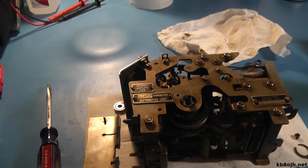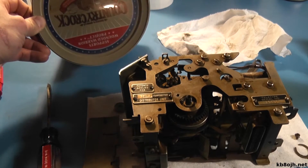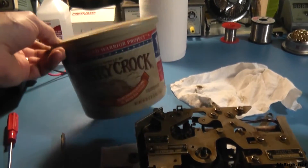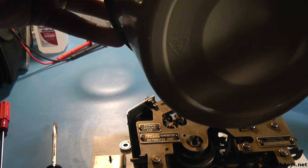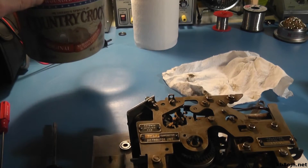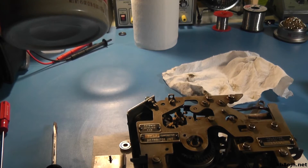These things are, you know, they're 60 years old and that oil has been rotting on there for the past 60 years. I was cleaning this thing up before Christmas and left for the holidays and was gone for a few days. I had been using some kerosene to take the oil off of these parts, and I had put it in one of these old Country Crock butter containers — it's polypropylene — and it turns out that kerosene apparently migrates through polypropylene, which was a little bit of news to me.